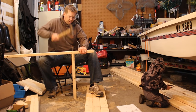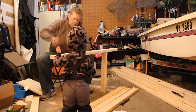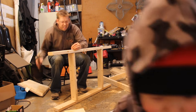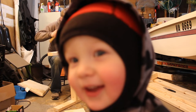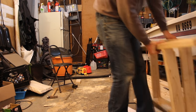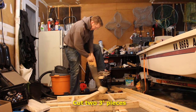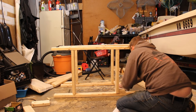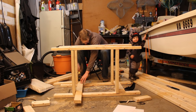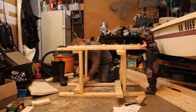I mark off the top and bottom shelf where I want them and start hammering it together. I put each shelf a foot from the end, but in hindsight I would have put the top shelf a little bit closer to the end of the four-foot post. Two of the cross members will be two-foot sections and the other two will be three-foot sections to make the little workspace. I'm using nails, but exterior deck screws would be a lot stronger. If I did it over, I would have used treated lumber too.